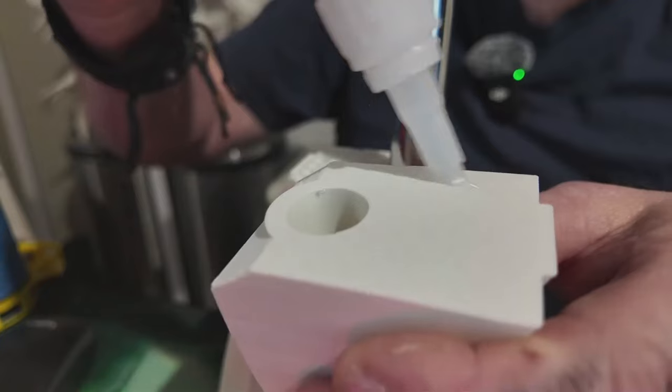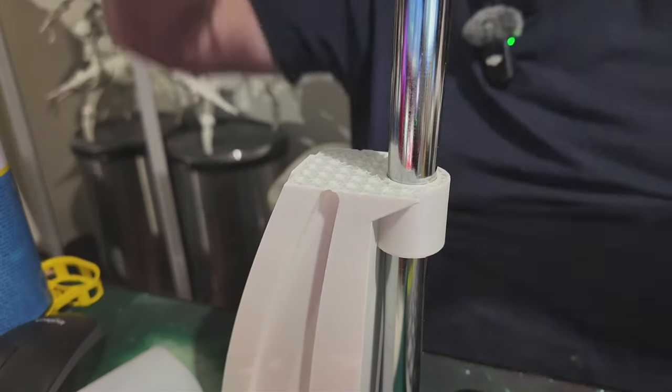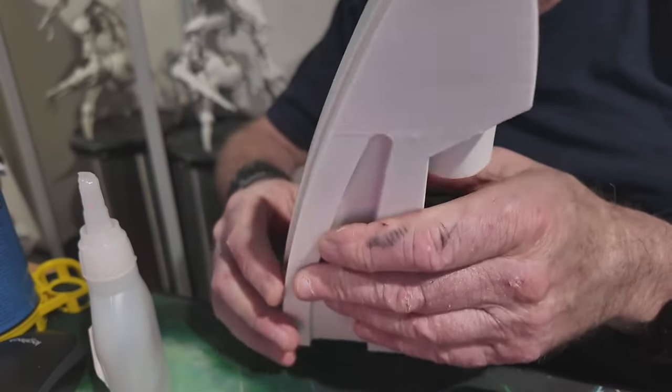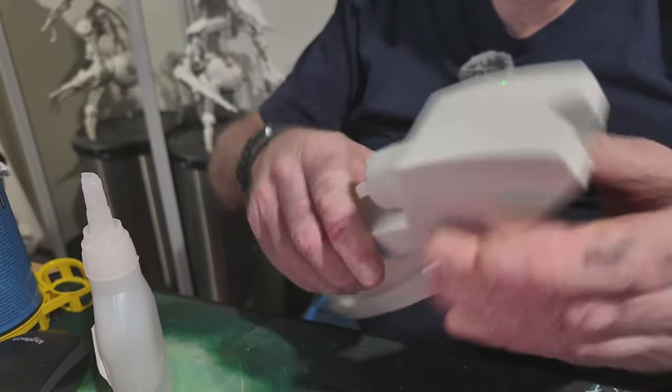For the pieces with a layer shift, I get the pole that's going to go in it, stick it in, then apply the correct amount of glue. I'm using a two-part glue with an accelerator — basically a super glue. I use the pole to line it up, get it where I want it, squeeze down, push down, and pull off. As you can see, it's a nice clean joint. It needs a little bit of spackling or Bondo, but it's pretty strong.